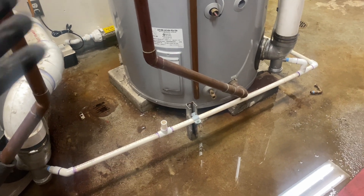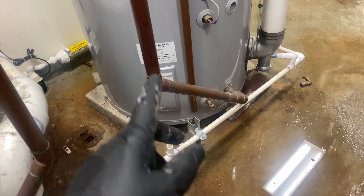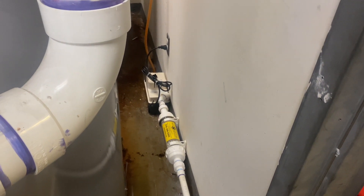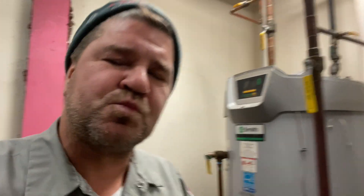There was a piece of Kindorf here — I didn't have any in my truck. I put a piece of Kindorf resting on the floor and threw on a Kindorf/Unistrut clamp. Coming across — there's that T picking up that water heater, going across, and voila — to the neutralizer and the condensate pump. And just in case any trolls are watching and think it's not pitched correctly — here's my torpedo level. By you watching my channel and engaging in the comments section, it strengthens the video and the channel. So thank you, kisses.